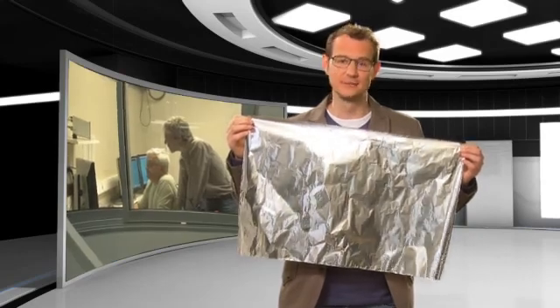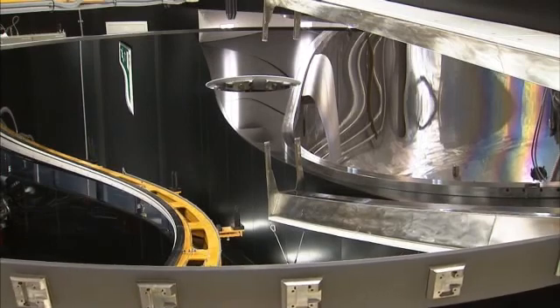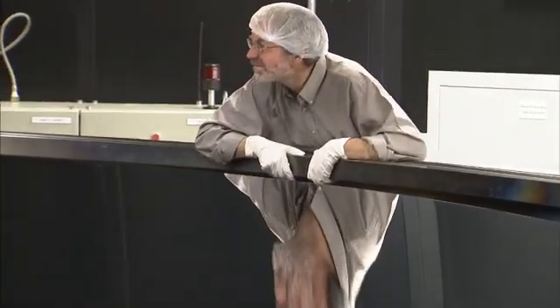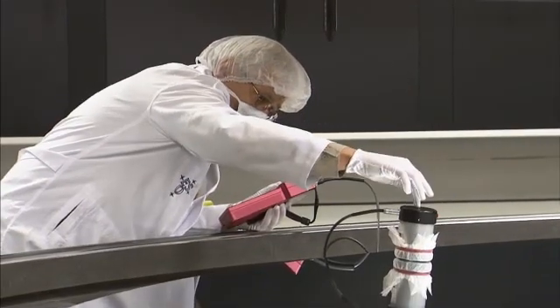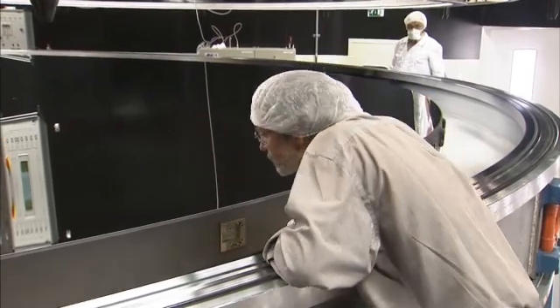And so the coating is only about 80 nanometres thick — it's really not a lot, is it? Finally, the moment of truth has come. Will the quality of the new coating meet the high standards of the VLT? Recoating a mirror is always a tricky business. If the mirror isn't thoroughly clean, or if the vacuum chamber is contaminated, then the coating will be flawed. Tension is high as the chamber opens and the mirror is brought out. A first visual inspection suggests that the recoating has succeeded. But what really matters is how reflective the mirror is, so the percentage of light the mirror reflects and scatters is measured. The result confirms the high reflectivity of the mirror, and the experts are fully satisfied. The recoating was successful and the mirror is all shiny and new again. The team is now ready to take the mirror back up the mountain and reinstall it at the telescope. The VLT will be back in full operation exactly on schedule, to provide astronomers with a superb view of our Universe once more.